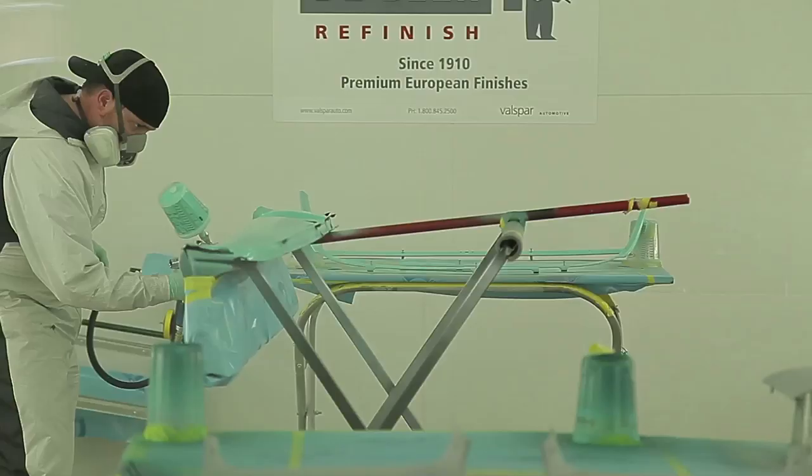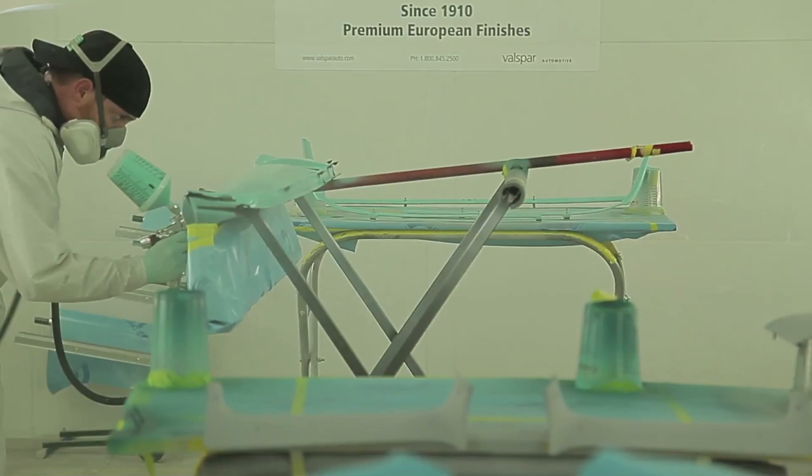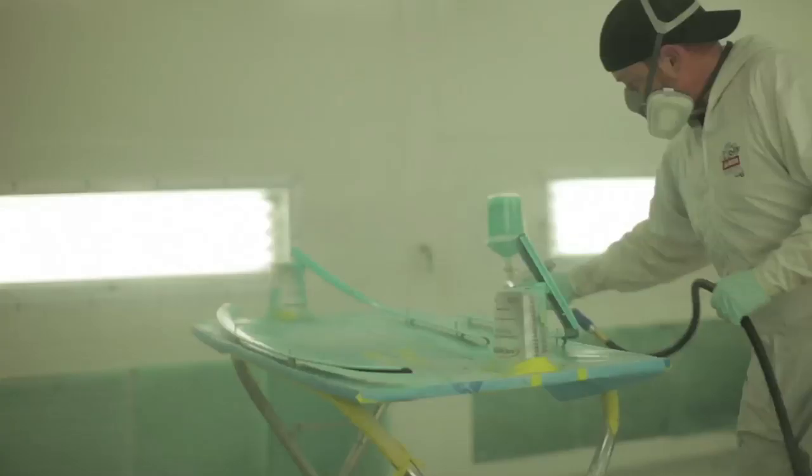I've noticed on the 4000, I can actually open my pattern up a little bit and drop the air pressure down, and it atomizes real nice. So that's nice in a whole lot of applications, and I don't know — to tell you the truth, it just sprays a lot better than the rest of them.